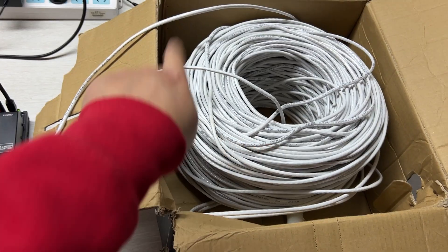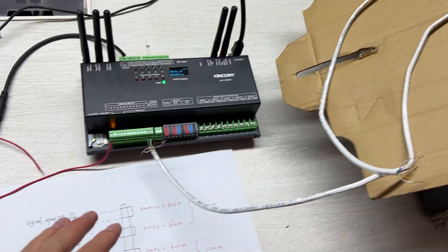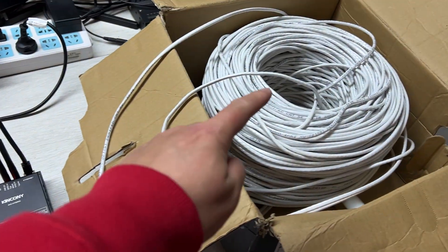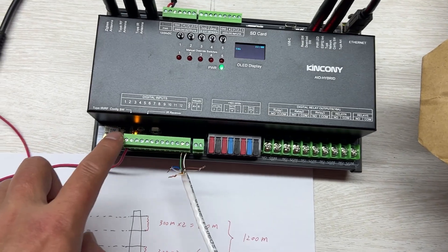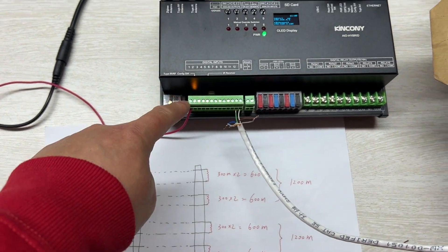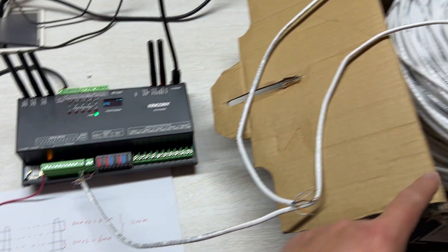So this can be enough for your dry contact sensor for long distance use. This is digital input - how to use it. You can use it with your dry contact sensor or voltage for long distance. Now you will understand how to use the digital input port - you can use either dry contact sensors or voltage input to the digital input. If you have any questions you can message us. Thanks for watching, see you next time.